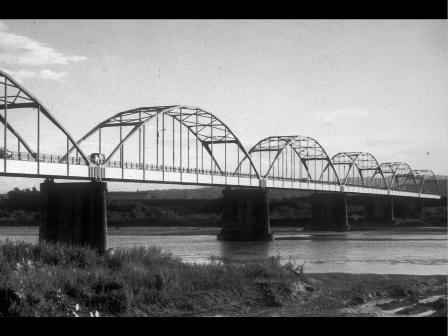The rise of this arch gives it a depth that is very large compared to the depth of the beam, so the arch clearly has a leverage advantage — it is the stiffest element and will pick up the gravity load. The beam would have to deflect far more to pick up that load, but the beam is deep enough to stiffen the arches against roll-through buckling. So it is a symbiotic relationship: the arch, with its high rise, is the primary support against gravity, while the beam returns the favor by forcing the arch to maintain its appropriate shape.